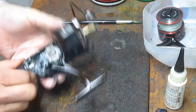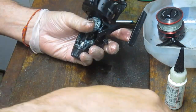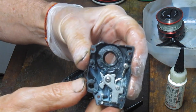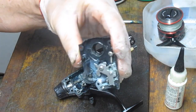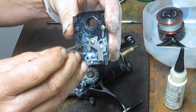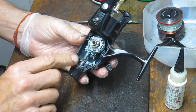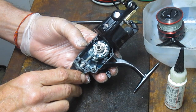Okay, this is a relatively simple and uncomplicated approach here for the gearing. This is a good time to take a picture. Now, we're not going to open this up, we don't need to, we're going to clean it up. We're not going to remove all these wonderful springs and things, which is what makes everything difficult in live liners. If you had a break, you could certainly do that, but you can see that we have a spring that's coiled around here. It's wrapped and it's set onto this little mechanism that becomes your trip mechanism. We have a little bit of congealed grease here, which we're going to treat by just giving it a good hosing of WD-40 to start degreasing that. And when we come over here, for the most part, everything seems to be just coagulated grease and dirt. So we can take care of that. So that's what we'll do now.